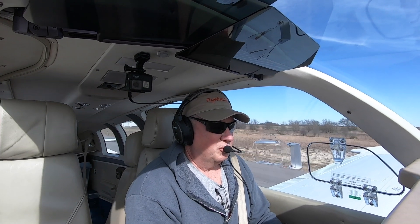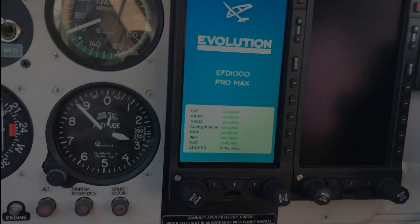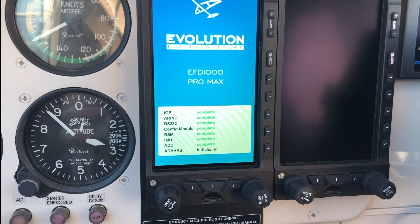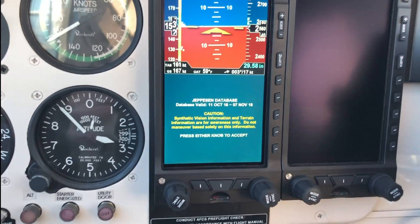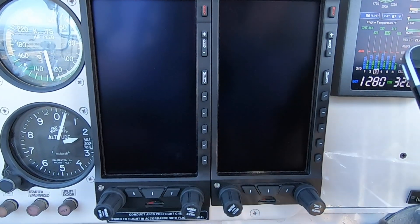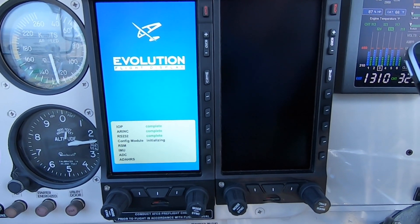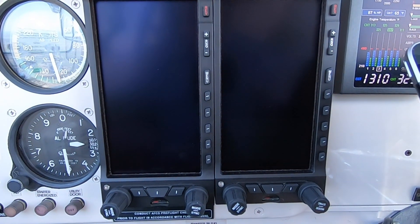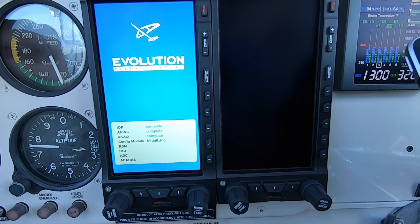These are both of the original Max units — EFD and MFD Pro Maxes. You can see the right one, the MFD, tried to boot and then it goes off. The left boots up, but the right one ends up stopping — not working at all. Watch this: it's going to start a boot and then redo it. Very frustrating. This would happen three or four times in flight. You can't fly IFR that way. You can fly VFR, but it's still maddening. You can't fly with the autopilot — it's a bit crazy.